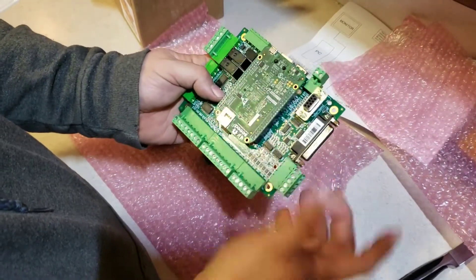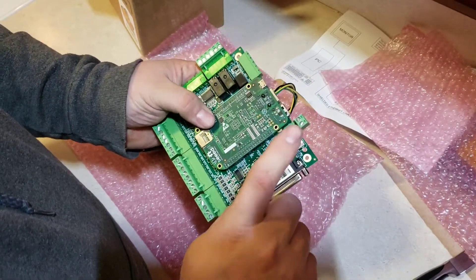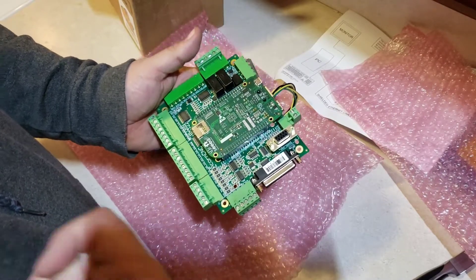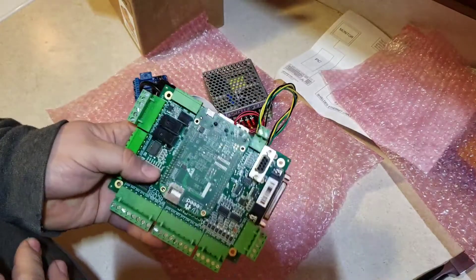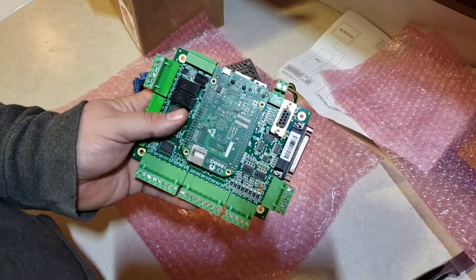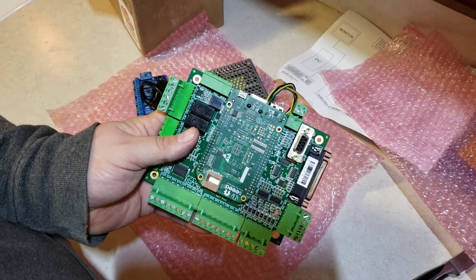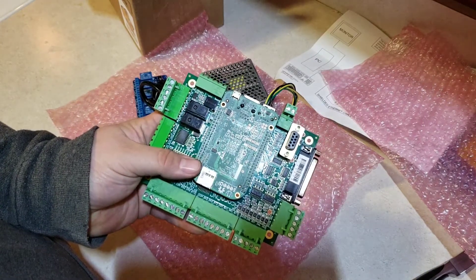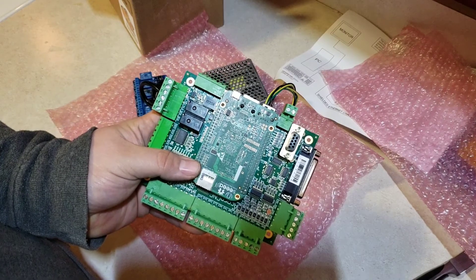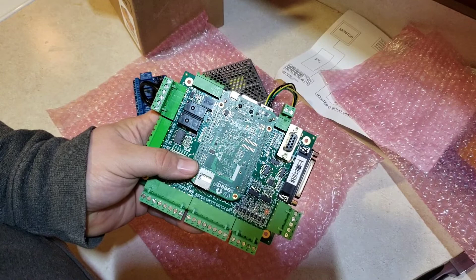I'm not using the DB25, and I do have an encoder on the way. For the encoder hookup I'll need to get a DB9 connector and figure that out. I'm still not sure how I'm going to drive the encoder — I think I can get away with using large timing belt pulleys, boring out the center of one to put on the spindle shaft. If not, I'll probably cut some nylon gears on the laser cutter and do it as a gear drive, one-to-one ratio.